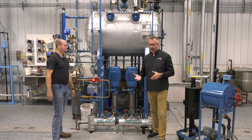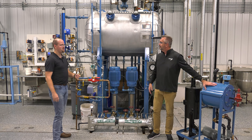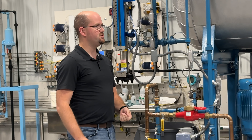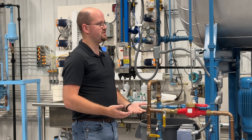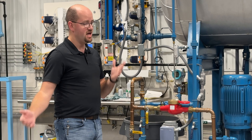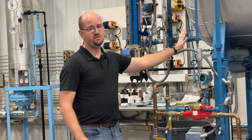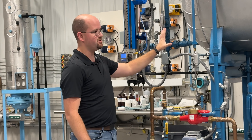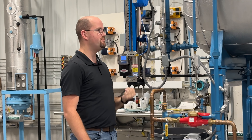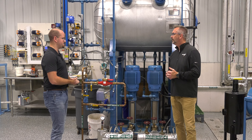So if you're not getting all the oxygen out, usually you're going to have to add a little bit more chemical treatment to your system. Typically you'll use an oxygen scavenging agent — some kind of chemical, whether it's a sulfite or something along those lines — to actually get more of that oxygen out. You'll still have to use chemical treatment even with a de-aerator; you can't avoid it, but the de-aerator helps get even more oxygen out and will keep your units healthier for a lot longer.